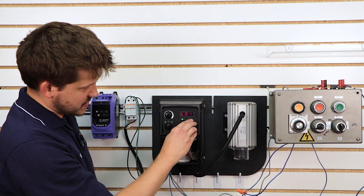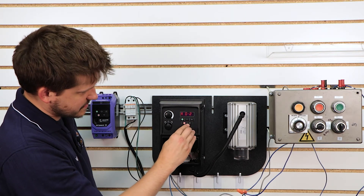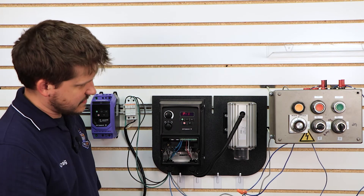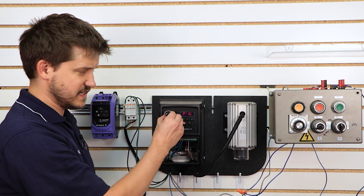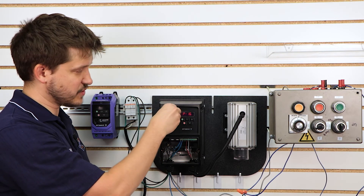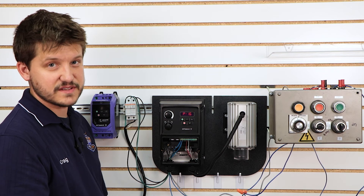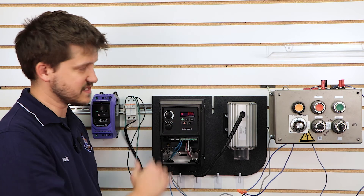Let me go ahead and show you what happens when I switch to that. Let's go up to in pot — integrated pot. Now the speed changed. That's because this integrated potentiometer is now being looked at for the speed. So depending on the drive you have — like if you have one of these IP20 units, it doesn't have an integrated pot, so the default is going to be 0 to 10 volts. If you're having issues with responsiveness from your analog inputs, make sure you double check P16.